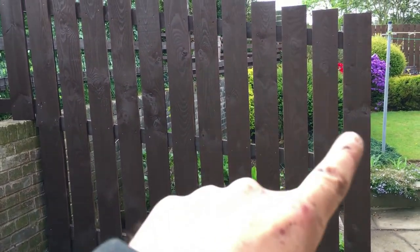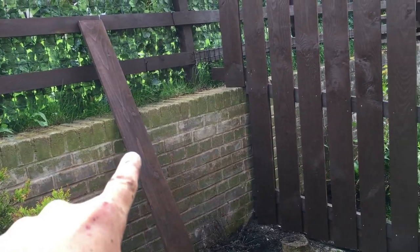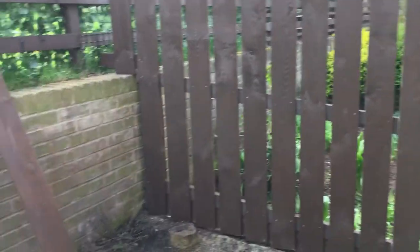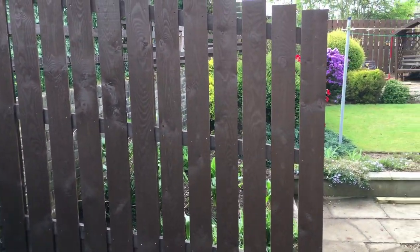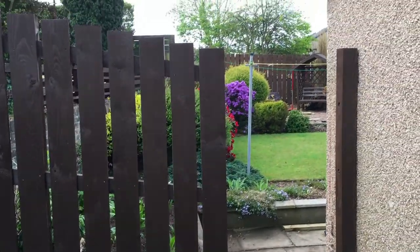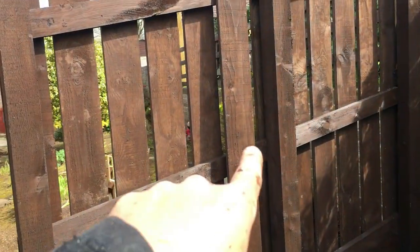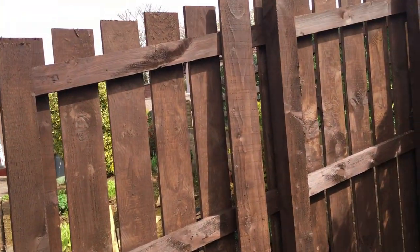Right guys, this one's progressing now. Basically built a single-slatted section of fence here, and we'll be fitting pre-painted boards on the reverse side of this to create a hit and miss fence down here. By doing that it just means you don't need to paint that side of the board through the gap, which could be a right pain. So we've done that in this section here. I don't know if you can see through the back section there - you can see this is what the fence will look like, with these boards all along there to close the gaps. So as I said, pre-painted - that'll get fitted to this side, so there'll be a row of slats all the way down here covering these gaps. All painted, so it just makes it a lot easier.